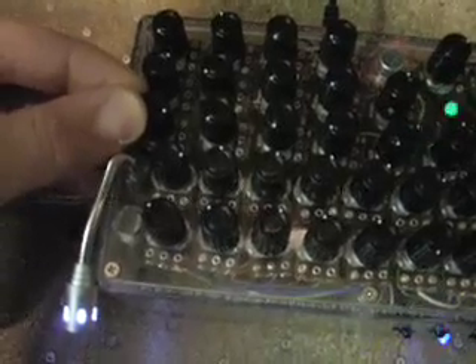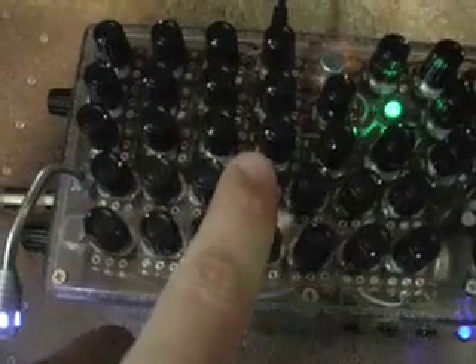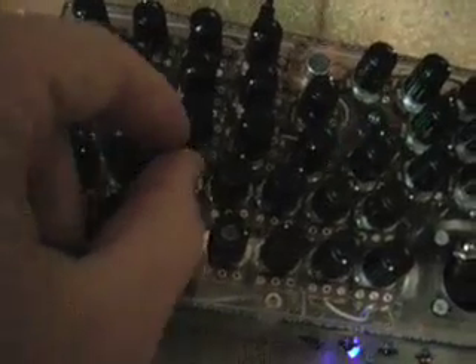The sequencer has nine controls and a bunch of LEDs. This knob here controls the sequencer rate — we get nice robot sounds. These eight knobs, one through eight, control the sequencer's different steps, so you can decide what frequency you want at various steps. It sequences in this direction, so just remember it goes kind of backwards. You can hear I can change the pattern by messing with these knobs, change the frequency. These LEDs down here show the sequencer running.